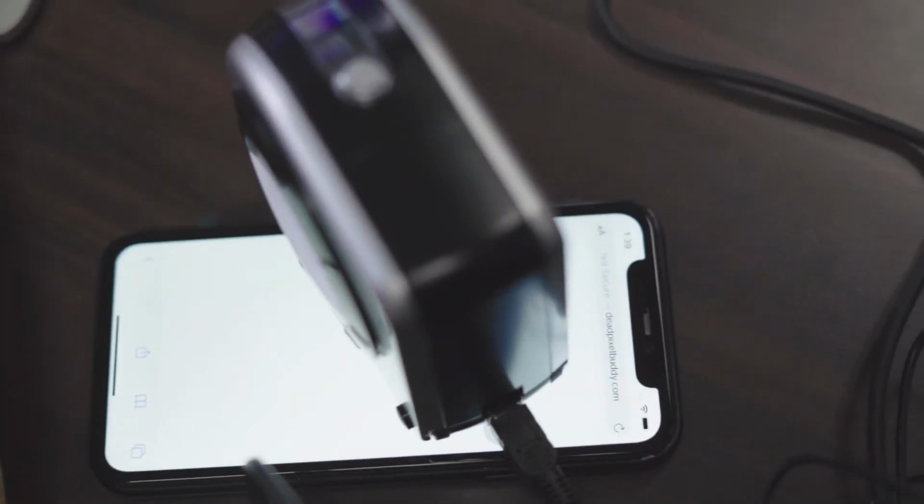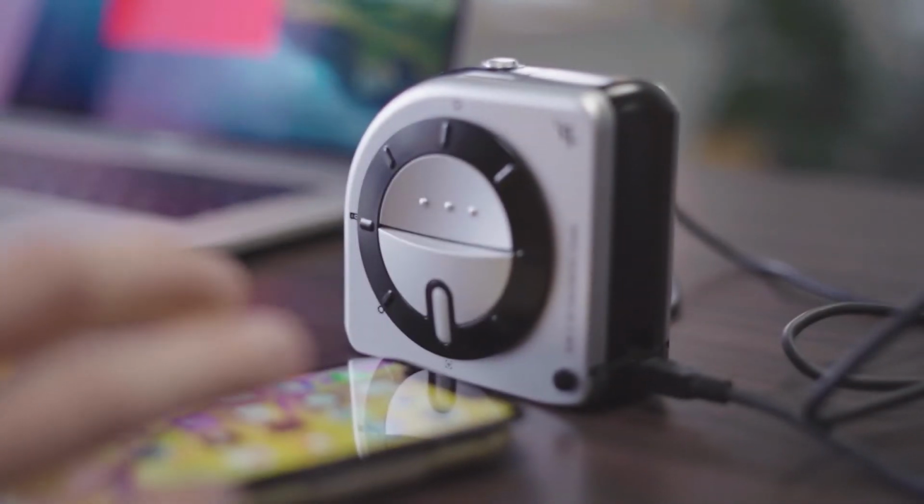Sometimes you just want to see how bright a screen gets. So you load a white image on that phone, crank the brightness as high as it goes, make sure there's nothing interfering with that in the settings of the phone, like auto brightness, and see how bright it gets. Other times, you want to test color accuracy, and max brightness is not necessarily a normal viewing environment for your phone. So you want to put it at a good midpoint.